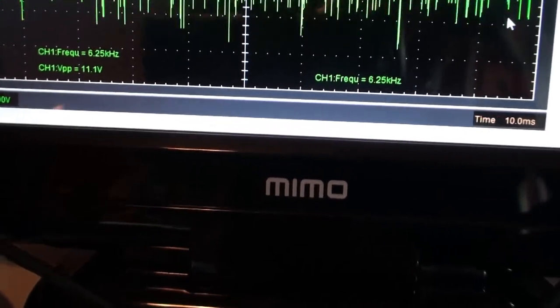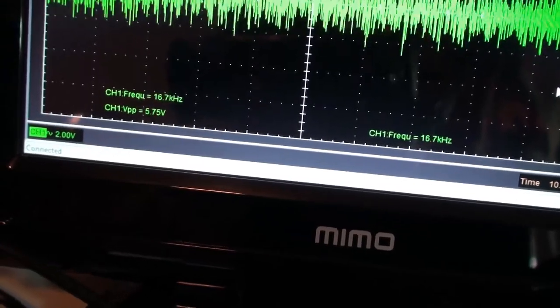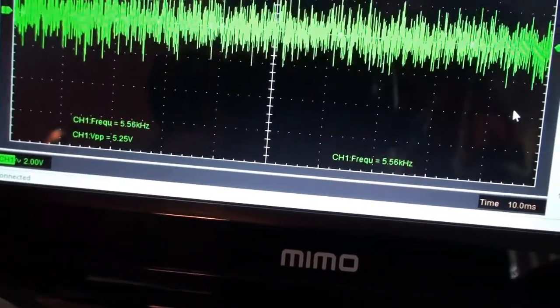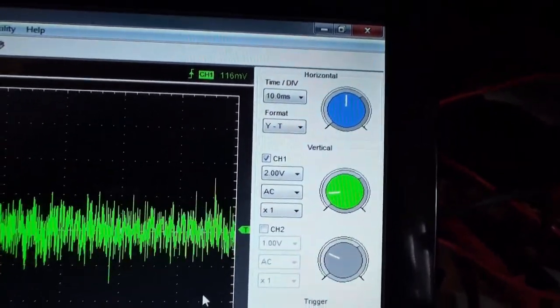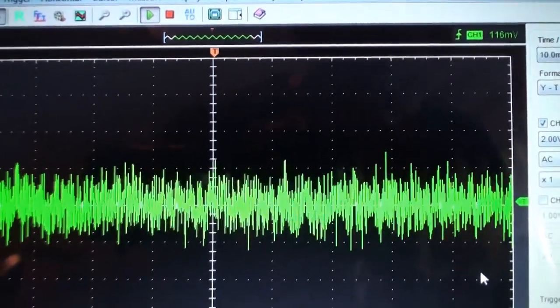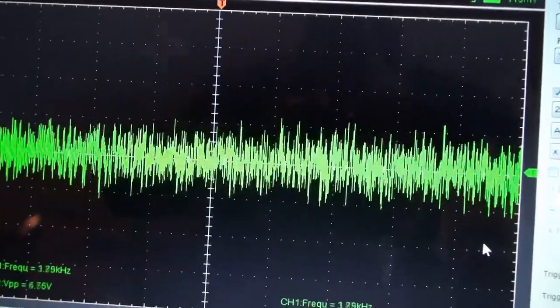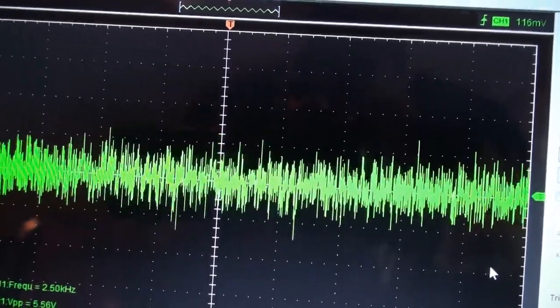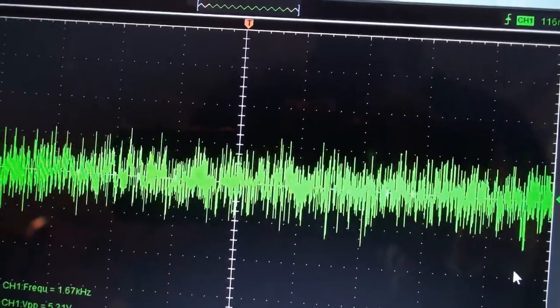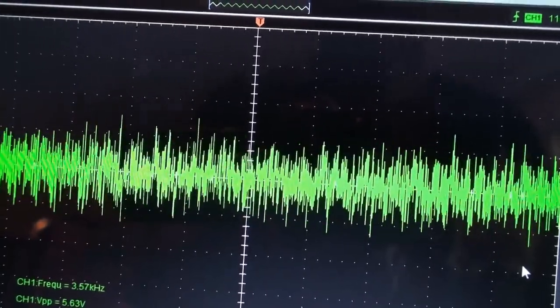So, drop a screwdriver in there and have a look at what we can achieve by twisting it. And as you can see, I can bring in this attenuation in here. And, yeah, you take a look at this, 2 volts per division, and then over here it's actually saying it's 5 volts peak to peak. A little bit tricky. It wants 4 volts peak to peak, the noise level, and I'm concerned that I might be making it too quiet. So really it's kind of a judgment call. I know what my grid says is 4 volts.